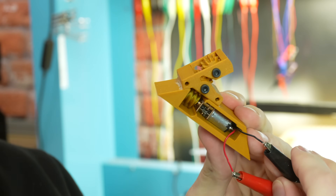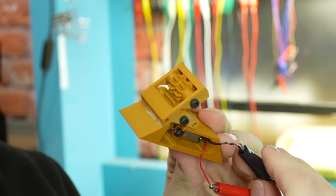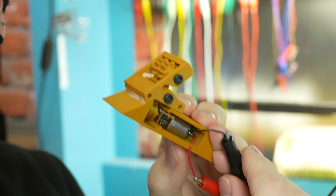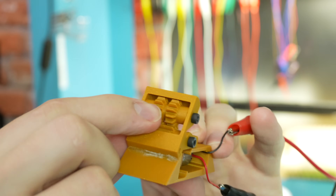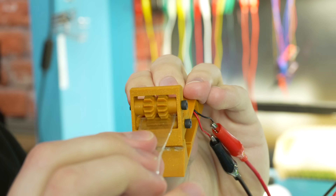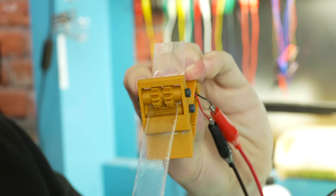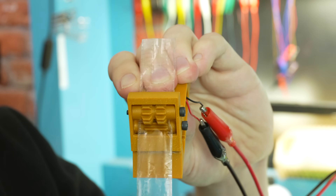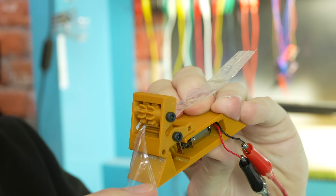I have some 24mm film here, and I'm going to power this motor with the same voltage we drive it on the feeder motherboard to see how well it works. The motor runs great — I cannot stop it. Let's try it with some film now. It has a good grip. I can still get a little slip if I really pull on it, which is exactly what I want — that's why it has the flexure in it.